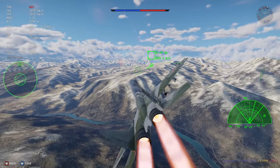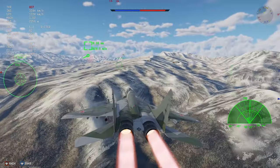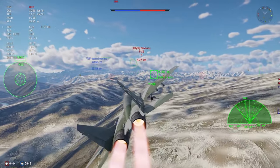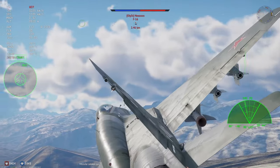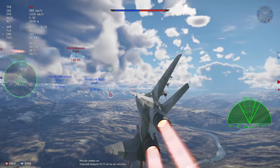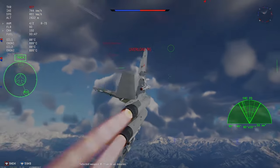Of course, tracking targets requires a certain amount of energy per radar beam to be reflected back to the receiver, so the radar can only track so many targets at a certain distance. As the distance closes in, the energy received increases due to the inverse square law, and thus more and more targets are allowed to be independently tracked by the AESA radar.